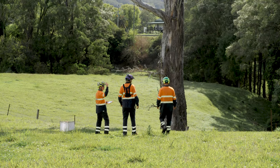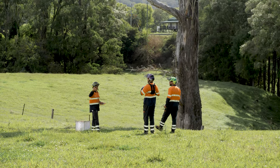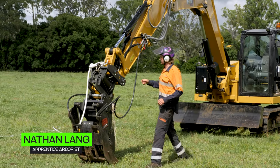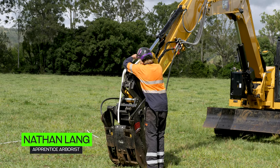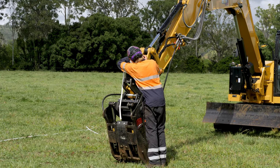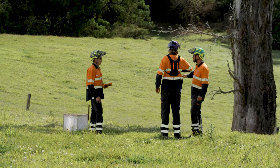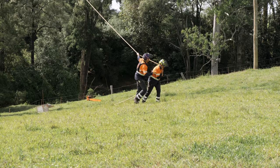We want two 20mm ropes in it. We'll have one as an anchor in the ute, and then one pulling with the excavator. And then obviously cutter, spotter, and tension guy line. Definitely two big ropes. We'll just have to give it a good test pull without you under it, because if we shake it and something snaps, it's going to fall on your head.